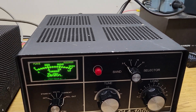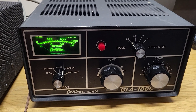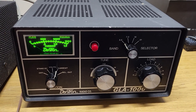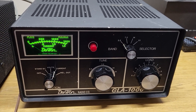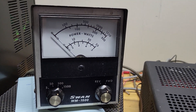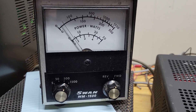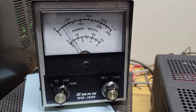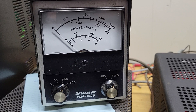I'm going to try to do a quick test. I've got it out of line, and I'm going to key it up with a relay that I have concocted. First, I'm going to show you the actual output of the radio. Here's our meter without the amplifier, and I've got it in the 500-watt setting. I'm whistling up to about 50 watts.